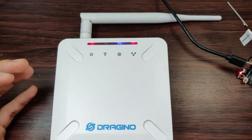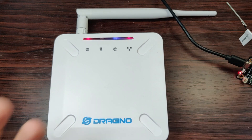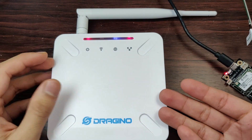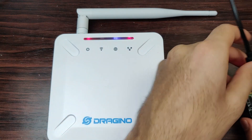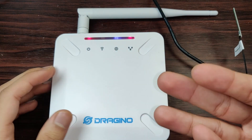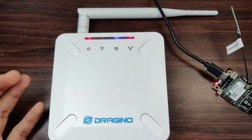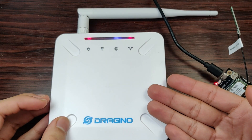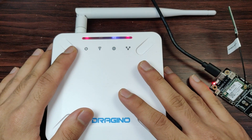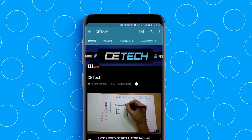That is how we set up this particular gateway. Even if you don't have Helium miners, you can buy the Dragino gateway — it's much less expensive than miners and also easier to get. You can develop and test your devices with this gateway configuration. Once tested, move your device from the staging console to the main Helium console and deploy it in the real world to connect with real miners. In the future, once stable, LoRa nodes configured on the normal console should also be able to connect to these gateways. If you want more Helium and LoRaWAN content, let me know in the comments. Thanks for watching — subscribe and hit the bell icon to stay notified.